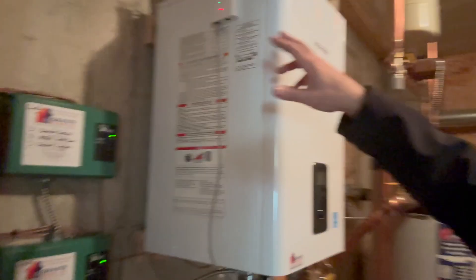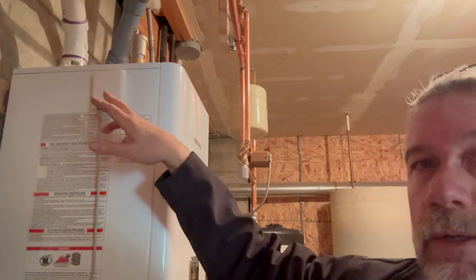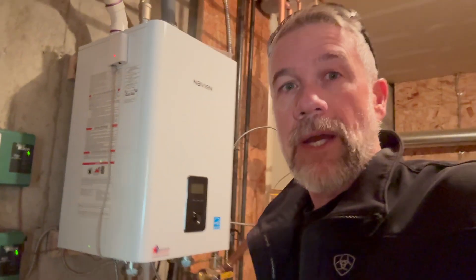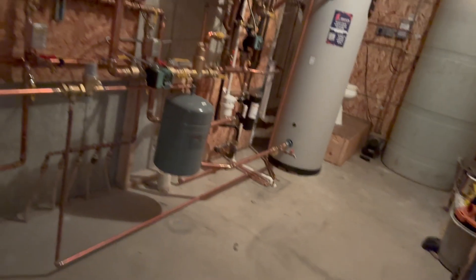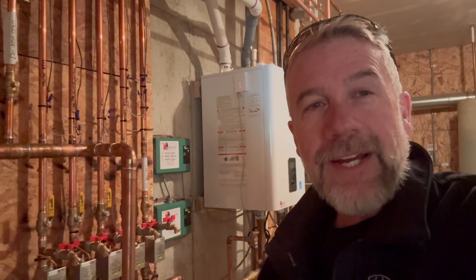We also went with the Navien Link light. We do have a little Wi-Fi issue — we're waiting for the customer to come home to deal with it because we need a 2.4 GHz network and that's not available — but we got it communicating with the fire tube boiler. Just wanted to give you guys a quick show of the work that we can do and how we can take an old cast iron boiler and move it right into the future. Sorry for the quality on this one — didn't have a lot of time to set up, but definitely wanted to film what we could. Thanks for coming along, see you guys in the next one.